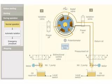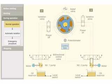When the rudder reaches the starboard position, the potentiometer sends a signal to the control box. The control box sends a signal to the bidirectional control valve. The valve is pushed back to its initial position. This blocks the oil flow and stops the movement of the rotor.